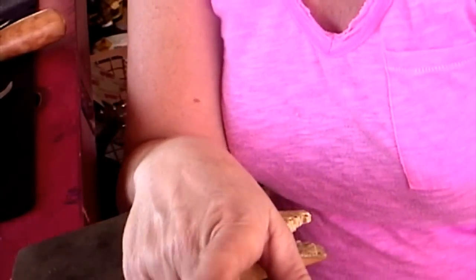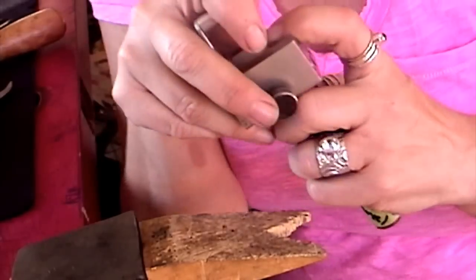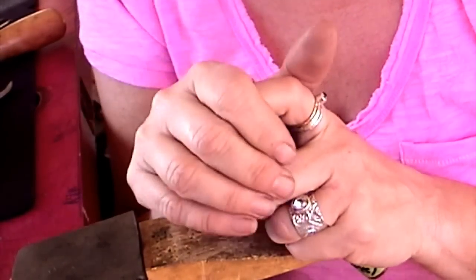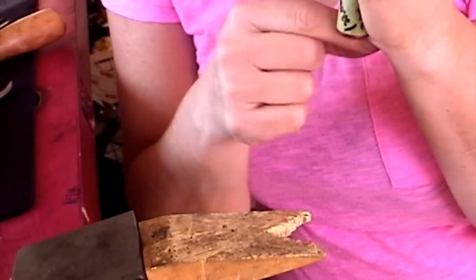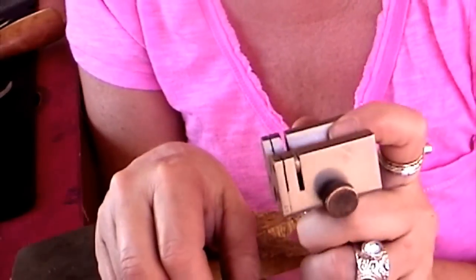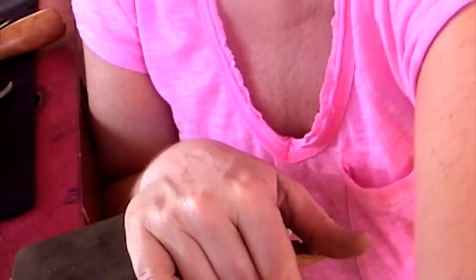So that's what the tube jig is for. They're wonderful. And also just for wire, if you've got a piece of wire you want to stick in there and get a nice flush cut, let's say you're making a 10-gauge ring or a 10-gauge bracelet, or you need some thick wires, you're making some big links, this is a great way to cut them for jump rings.